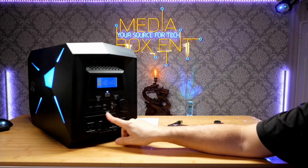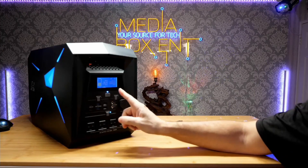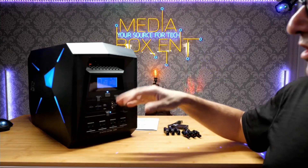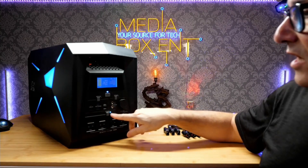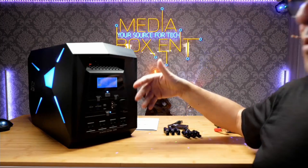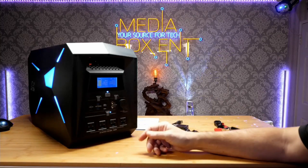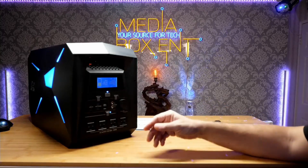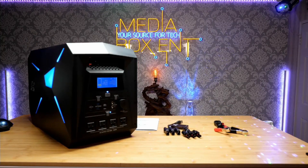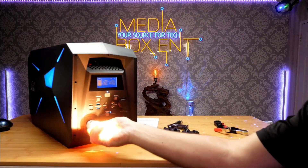Now here we have the AC. Turn it on only if you need it. One important thing about this unit: when you turn on the AC inverter, it starts using energy and will consume power. So it will eventually run out of battery even if you don't plug anything in. Let me grab one of my lights to demonstrate.